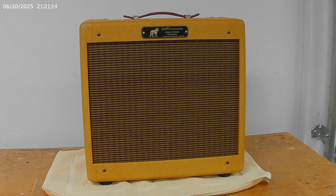Those are the two major components. You will see amps today that appear like they have a floating baffle. A good example would be some of Fender's Hot Rod Deluxes — it uses this same sort of mounting system that you're seeing here — but the baffle itself will be like an inch thick, and it will be particle board MDF, and it's just too heavy to resonate. So you just no longer get the floating baffle effect out of that.